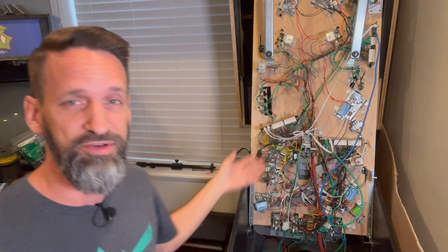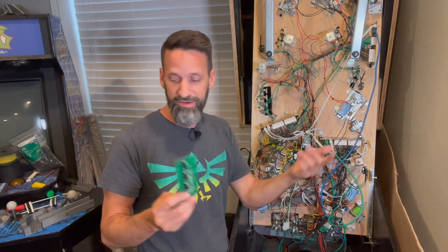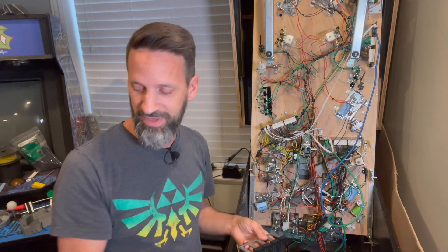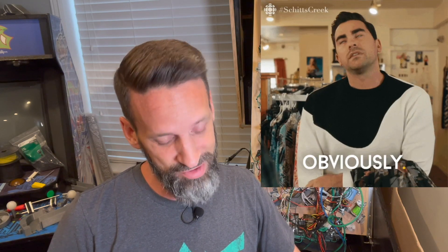I kind of gave up on STB for a while and moved on — we didn't have this working at the show in Portland. Then, against all better judgment, I put an aftermarket board on here because I fried my original board. Even though it clearly says five-volt in, and I knew I should only ever connect five volts, because all my other optos run off 12 volts I thought, well, maybe if I run it through the FAST opto board with 12-volt filtered power — part of me was screaming in my head: what are you doing?